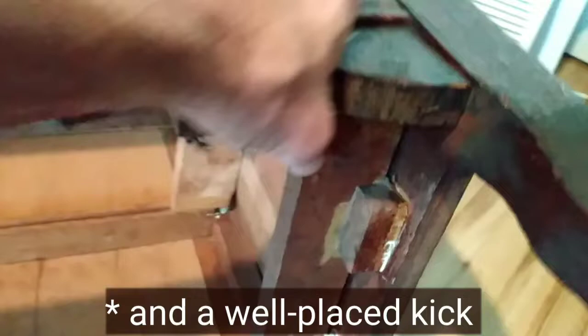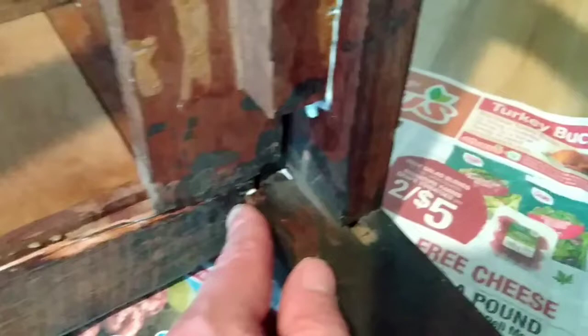Shoring and gluing up this part of the dresser has come out very well — actually better than anticipated. It took quite a bit of pushing and a little bit of light pounding this way and downward, as this was all lifted up as well. All four of these pieces were separated in one way or another and that's seated really nicely. Tongue and grooves firmly in place, and this piece has been secured back on and those other places have all been shored up as well.